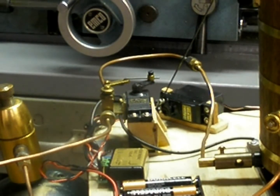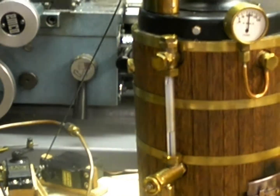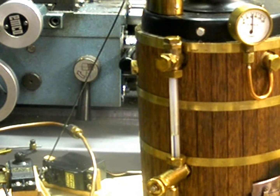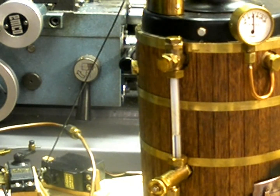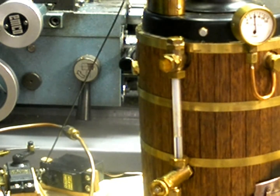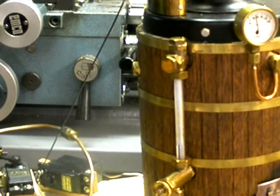Since the temperature is monitored with a thermocouple, it adjusts the burner from an idle condition to full burner when the pressure drops. Hopefully pretty quickly that valve will turn the burner back on. I can get rid of some more steam — there it went.